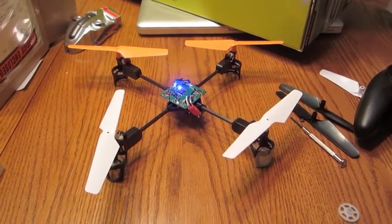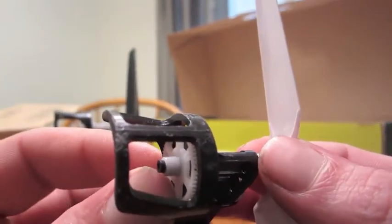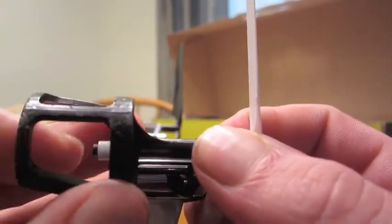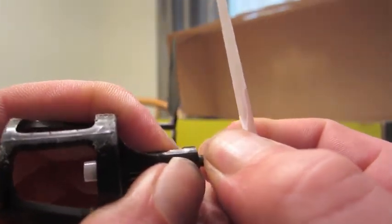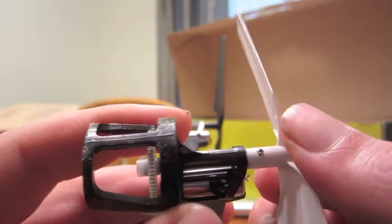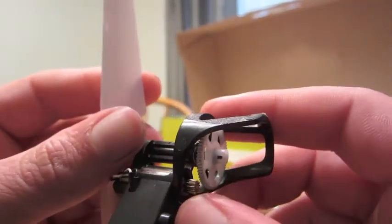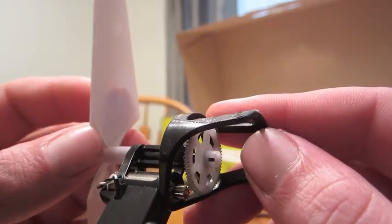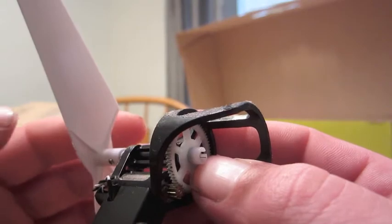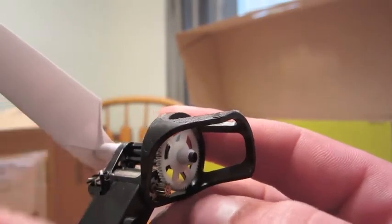After a crash, you go to fire up the quadcopter and only three of your props are working. One of the first things I started to notice going wrong when I would crash the quadcopter quite often is the prop itself would slip. If you watch the black prop right there, see how it slips? So on impact, it would slip out of the wheel, not usually all the way off, but just so that the wheel would have some play in it. And when that happened, the wheel would no longer meet the little drive coming out of the bottom of the engine. So when it would slip down like so, the engine would spin, but there'd be no connection to the wheel. So in order to fix that, I would simply slide it back up to where it's connected to the motor's drive shaft and then push the prop back in and back in business.